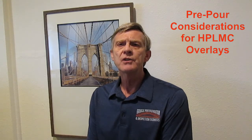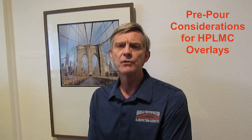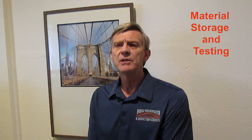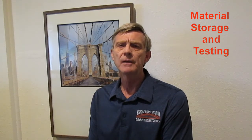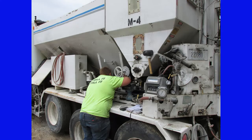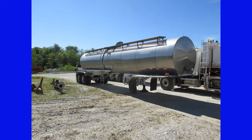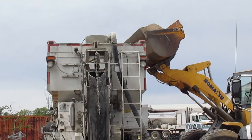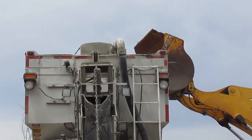We are still in our series on pre-pour considerations for HPLMC overlays. This week, we are going to talk about the material storage on site and the testing of the HPLMC mix prior to dispensing. Since HPLMC is volumetrically mixed, it will be necessary to calibrate the mixer and have all the needed components on site, stored or stockpiled in convenient locations to work with in close proximity to the bridge, in order to efficiently recharge the mixer for continuous pouring.